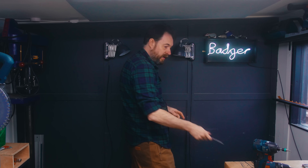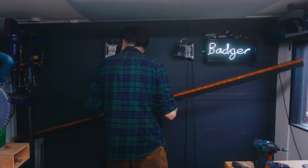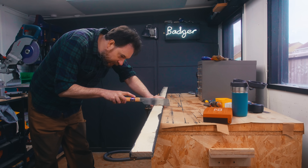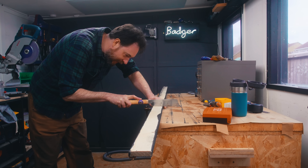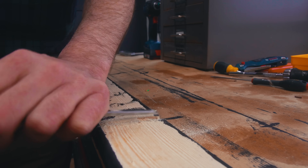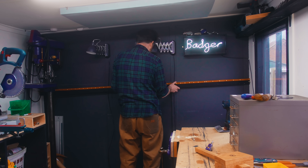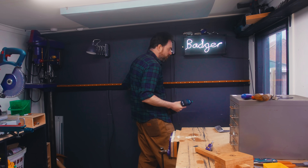The two lights are there, but the trouble is we now have cables that are going to be in the way of the chisel rack. So I'm going to offer the rack up and mark out where the cable is going to go on it, then cut down on those lines and grab a chisel to remove the waste and create a little channel for the cable. I think we can now get this into place finally — make sure the cables go in the little slots, then get a big screw in each end to lock it into place, and wind in all the brass screws fully.